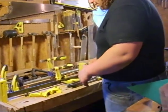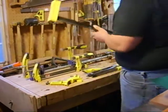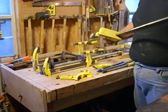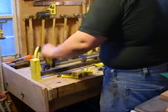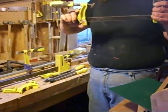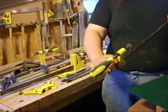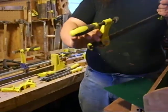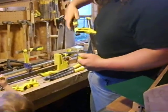There are different types of clamps. This right here is a parallel clamp. It has two large jaws that are meant to clamp work parallel and square to each other. This is an F clamp, which works by providing localized pressure. You have a movable jaw that you release, move to an initial depth, then use the adjustment screw to do the final tightening.